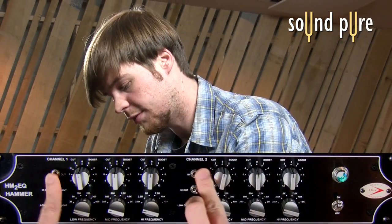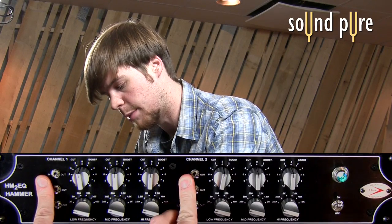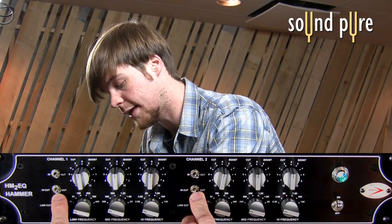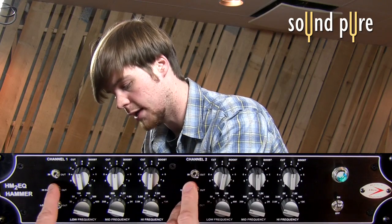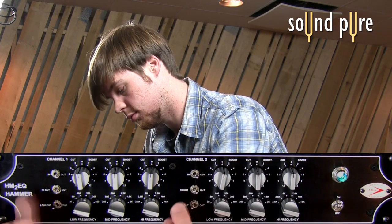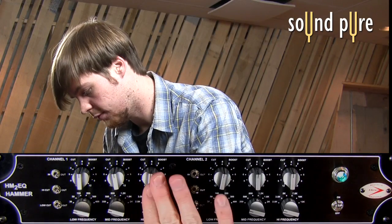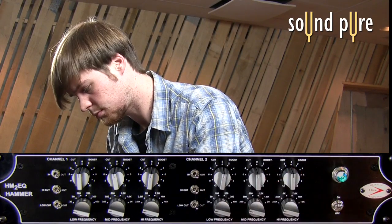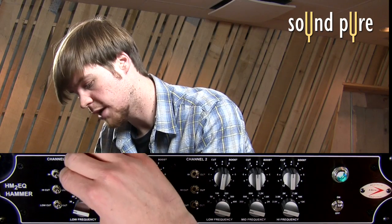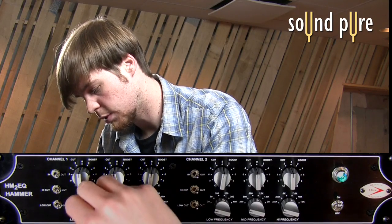As you can see on the front panel, it's got a true bypass, so in and out to completely bypass the unit. You have a high cut that rolls off 12 dB at 8K. Once again, simple engage and disengage. And a low cut at 84 Hz. Engage and disengage. Okay, so here's our three bands, obviously on each channel. And essentially, a plus 12 or a minus 12 is what I have, and detented frequencies of choices on each channel.